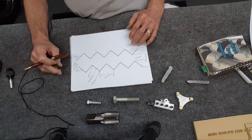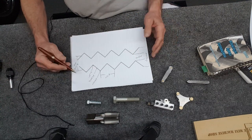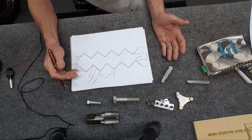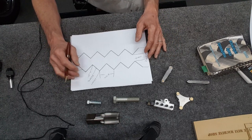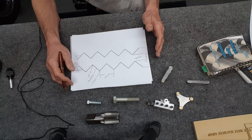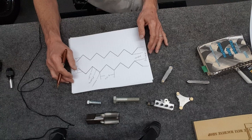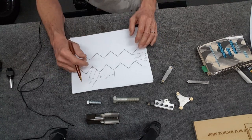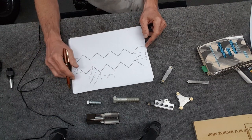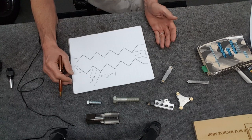And when you're trying to thread something, there's lots of different ways of measuring it. You've got gauge pins and you mic them, and there's a micrometer that can go in there, and so on. But there's also how deep you want to go. I'll put a link to the place. Greene Tool Systems has some calculators on their website, which is really cool. One calculator says how much thread engagement you want between the screw and the nut. For some reason their calculator only says 65, 70, or 75%. Why can't you go any higher?